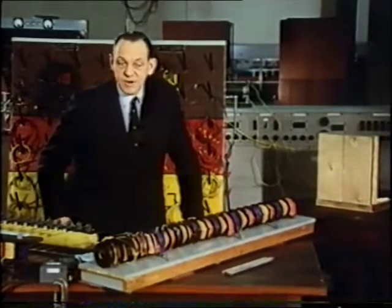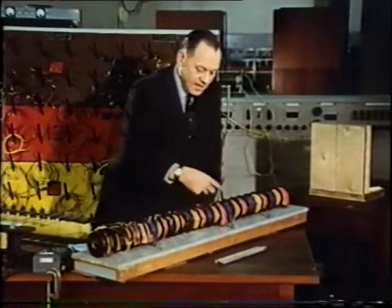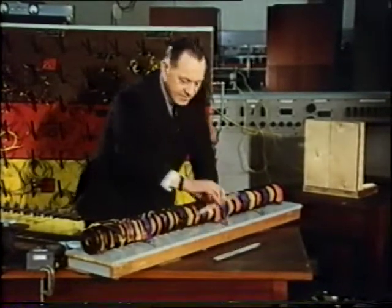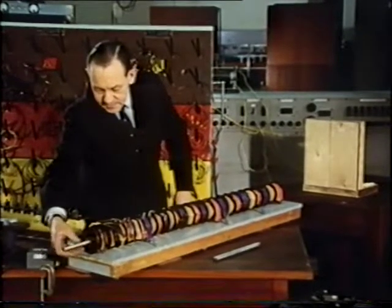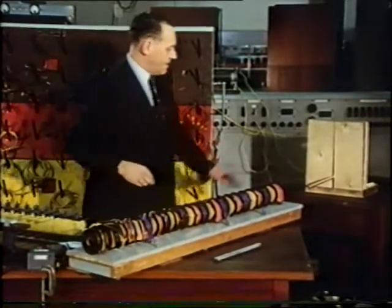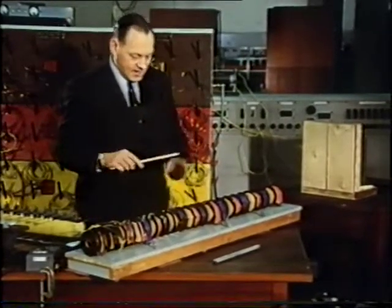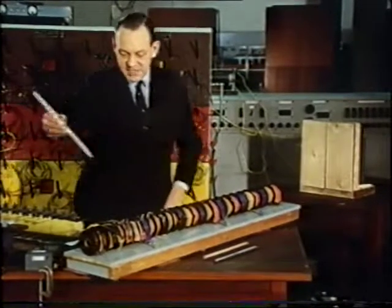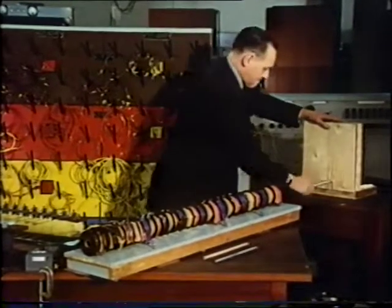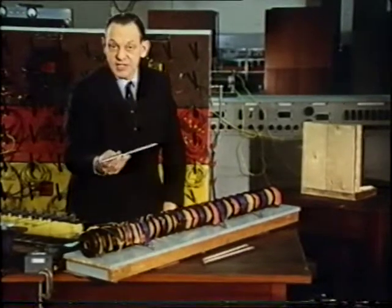Now in practice, it's very easy to construct one of these guns, because all you need is a whole row of coils placed next to each other. And each coil is simply a coil of wire wrapped on a bobbin. The moving part is going to be a steel rod with a copper sleeve on the outside of it. I put it into the barrel and switch on. The missile emerges at about 100 miles an hour and goes quite a long way into the wood. We can try more sophisticated darts — this one has alternate rings of steel and copper on a steel core. A plain steel rod does remarkably well because steel, remember, is a conductor of electricity as well as of magnetism.